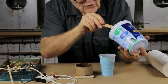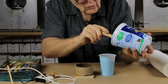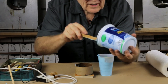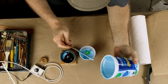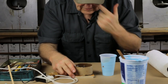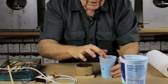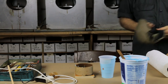Even with the chilling, this rubber is beginning to gel. It's 90 degrees in the studio, and temperature really matters to these materials. I'm very pleased that I got the difficult part of the mold cast and done before it got too goopy. I think the bubbles in this one are going to rise out just fine. I've got these things filled — and because this video is long enough, let's get these molds out of their cases.